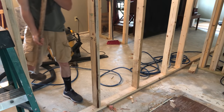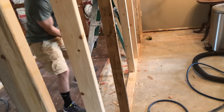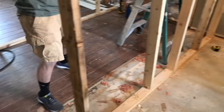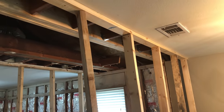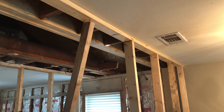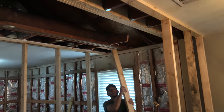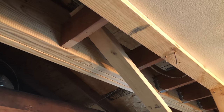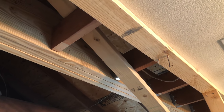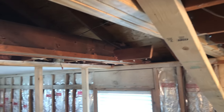What we're going to do right now is knock out these two temporary studs with a sledgehammer. We've got a strong back in the attic holding up the joists, so it's going to be okay to remove these pieces of wood in order to get these boards down. If we have to remove more we will, but we're starting with these two. And now you just pull them down by hand. Like I said, the gyms are closed. So we use a two by four stuck up in here, use the joist ahead of it as a pivot point. Yeah, it's coming down. We can work with that.